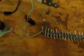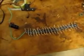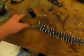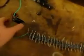You charge your capacitor up to hold a high current that discharges through your diodes, and a lot of the times it blows your diodes up. I like using a bridge rectifier, and when something bad happens, your bridge gets blown up and your diodes get blown up. So to prevent wasting my money and my time, I use this fuel cell, which consumes 1 amp to 1.5 amps. I put this in series with a bridge rectifier, which charges the capacitor. And when this dead shorts through the plug, or when the capacitor is fully drained, the only bad thing that's going to happen is I'm going to produce hydrogen.